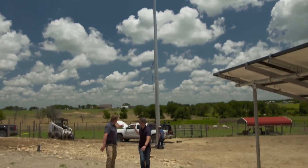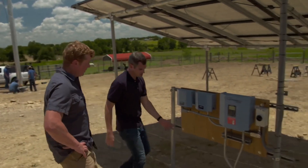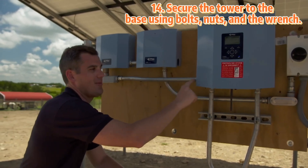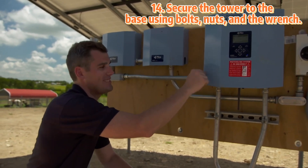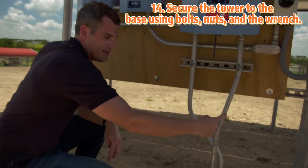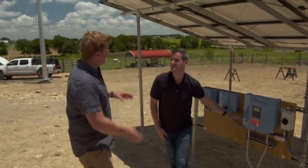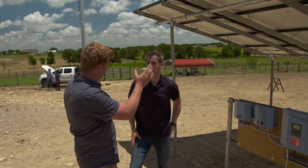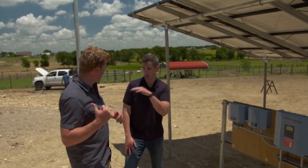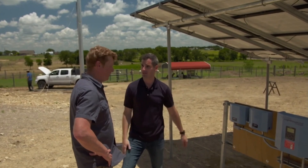We've got a wire at the base of that tower, and we've run it underground — two of them. It comes in on this conduit right here and feeds into our inverter. We also have solar power coming into our inverter. Both are DC power, and they get converted here to AC power, which feeds out through this conduit to our house and barn. When we need power, it will first draw from this system — either solar or wind, or both. And if we need more power than we generate, it grabs it from the grid. If we generate more than we need, our meter spins backwards, we feed the grid, and our neighbors get to use some clean electricity.